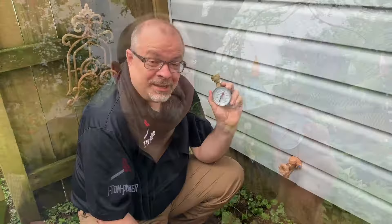Let me start by telling you a little bit about the water pressure gauge that I have. There are basically two kinds of water pressure gauge: one with this red hand that you can see here and a black hand, then there's others with just the black hand. The black hand is telling you what the water pressure is at the time you're taking the measurement. The red hand, if you decide to buy that particular kind, is telling you — if you leave the water pressure gauge on a spigot — where the highest fluctuation of water pressure was over time. But in any case, you can use either one; it doesn't matter. The single hand is going to cost a little bit less, but they're only like 10 to 20 bucks. So this is a really inexpensive way to make sure your water pressure in your house is correct to your liking, but also not destroying or damaging your pipes over time.